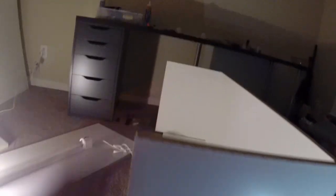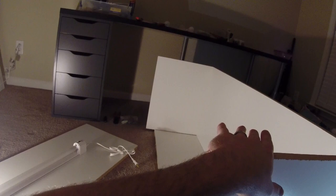You'll screw in all your screw holes, pilot first and then your screws. You'll make your back piece and your side pieces, and then you'll throw on your top and bottom. Now that you have your side, back, and other side on, it essentially looks like this. Four screws right on the back side. You're going to place your bottom piece first, screw it in at multiple locations across the bottom, and then we'll flip it and add the top. Make your pilots first and then go along the melamine and screw in.